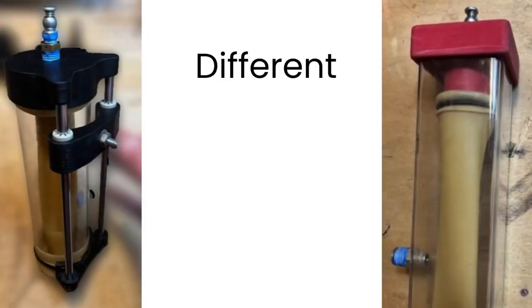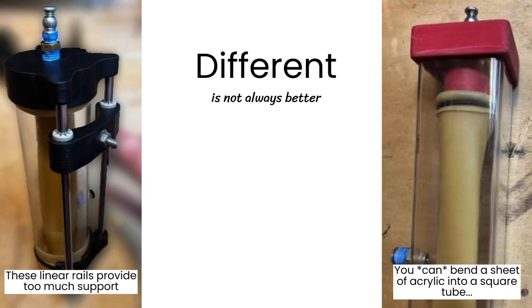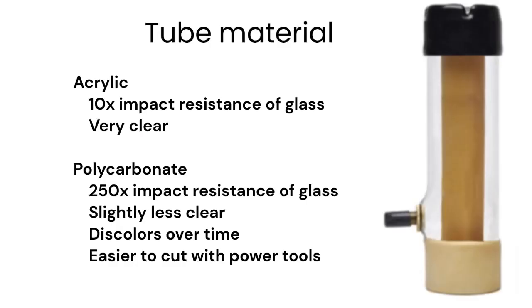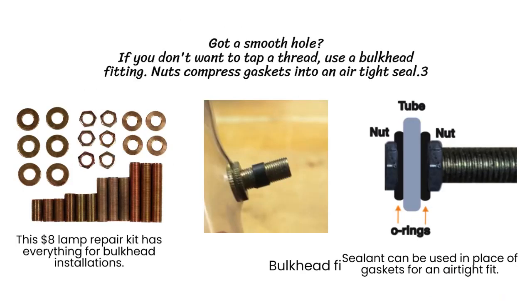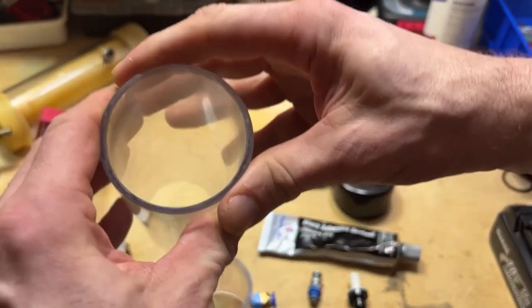Here are a few things that I do differently. I wanted to use the same tube with my other machines, like my pump, which has a wider range of pressures and levels of stress on it, so I needed a stronger plastic. I also wanted to be able to try different fittings for the port, and the bulkhead style fittings with nuts on the inside and outside of the tube make it really difficult. So I decided to go with 1/8 inch polycarbonate — the walls are thick enough to tap, and it's strong enough to hold a thread.